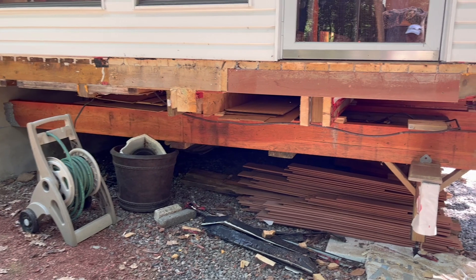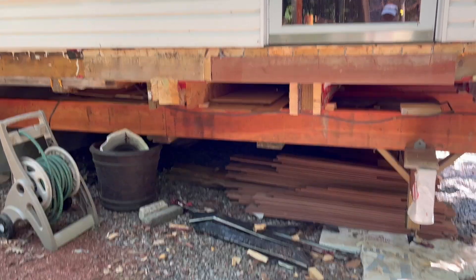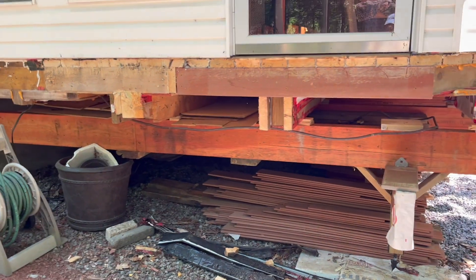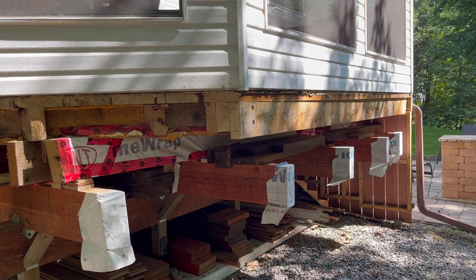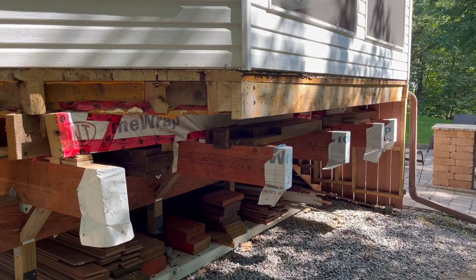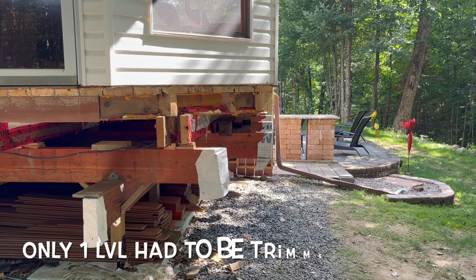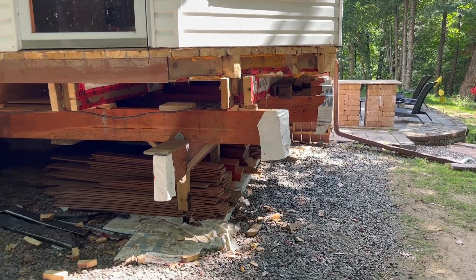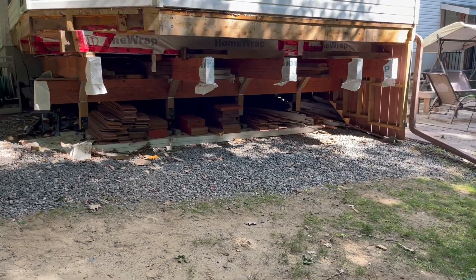It's coming along nice. A bit more work, a bit more prep work. I've cut down all the 2x6s, all the excess wood that was hanging over on this side. I've even removed the old drip edge that I had when we had the deck at the time — same thing on the front. Drip edge is gone. Now I'll be getting a vinyl drip edge, white, to go over what I'm going to install. I still have some adjusting to do, cutting down those LVLs to be a bit more behind that joist. But the underneath looks amazing — hasn't looked that nice in a long, long time.